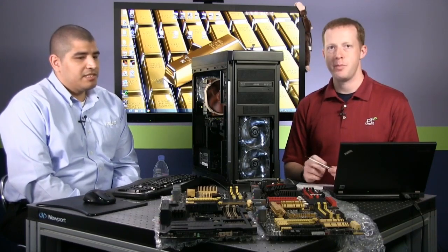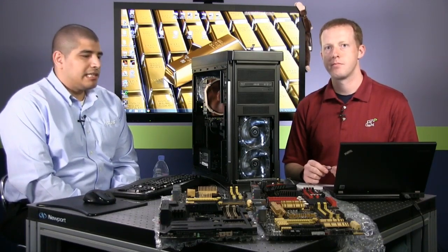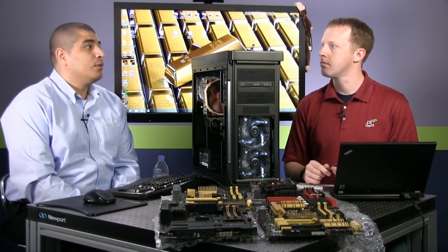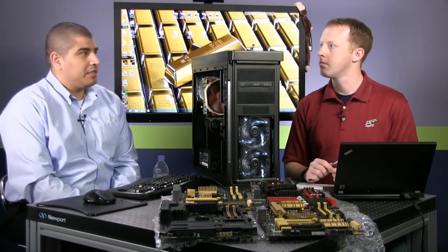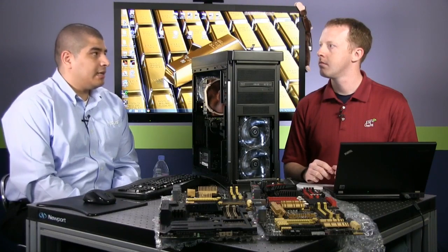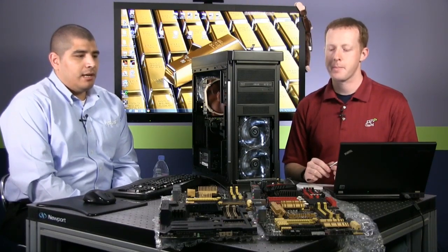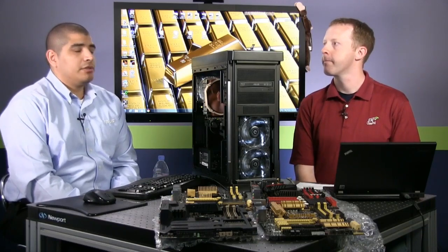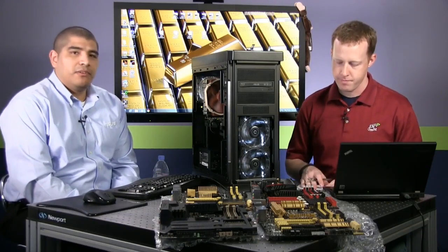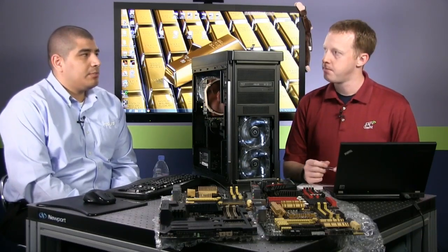Yeah, correct. The "up to 6" is important because while technically it can allow for up to 6, there is the flexible I/O specification aspect of it, which adds some variability into how certain things are mapped depending on the motherboard design and things along those lines. But I think you're right in saying overall it's going to feel pretty similar, for all intents and purposes, to the previous generation platforms, whether we're talking about Sandy Bridge or Ivy Bridge.